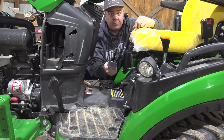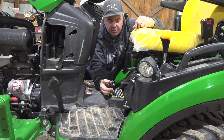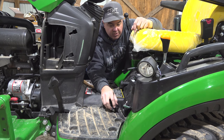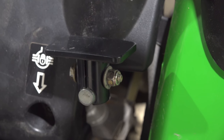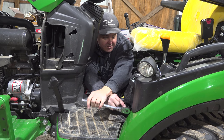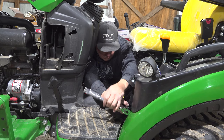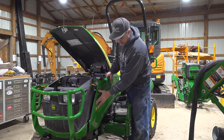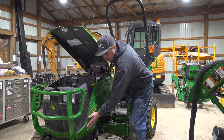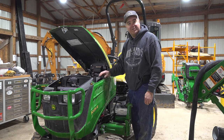I wonder if Ken's differential lock pedal will work on here. When we did the original differential lock pedal install, we showed you there's a little slot right here on the back side — there is a front and a back to this device. That little slot goes over this knob right there, slides right on, and then it's just a 7/16ths to snug it right up. Now we'll put this side panel back on — get the back side in, the front down in here, and slide it forward. These new little fasteners connect it all up. All done — no wrenches, Christy.